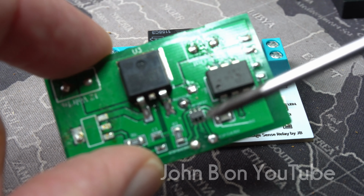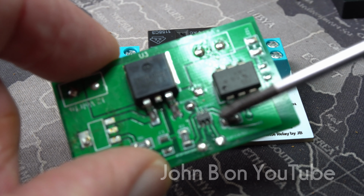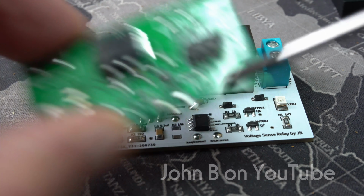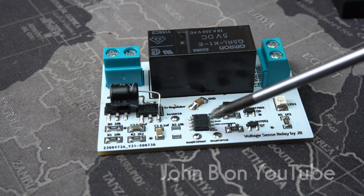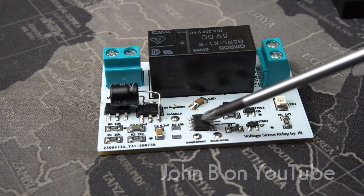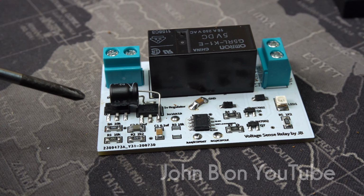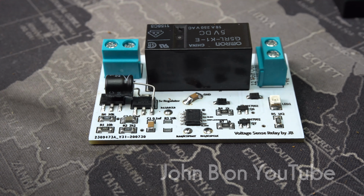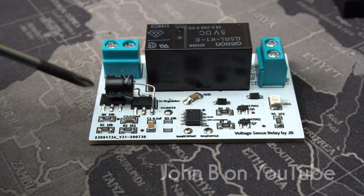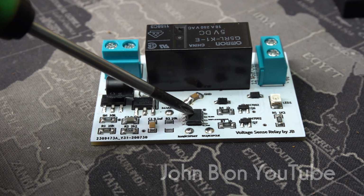So it's got a few input and output channels, same as this. And more importantly, it's got a 10-bit ADC and it's got an internal temperature sensor. And so is this, as I say, PIC 12F1572, 44p each plus the VAT. So my friend has one of these in his Transit. I made it versatile. So this is a P-channel MOSFET, stop you blowing the circuit up if you wire it up back to front. This is 5 volt regulator, that's the PIC.